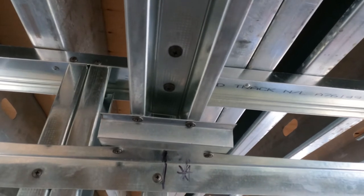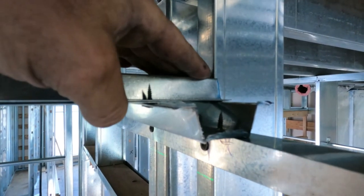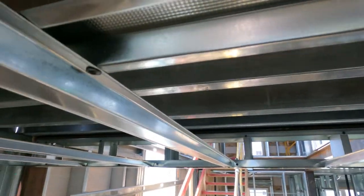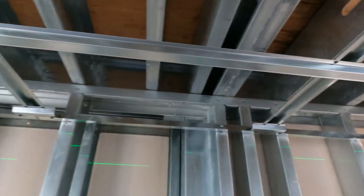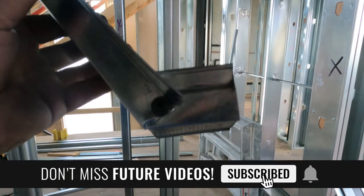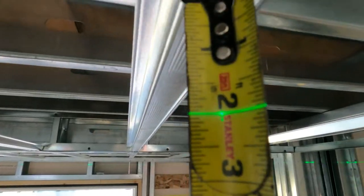Look at the screws — that's what I'm trying to say. You see how the hat track brace goes all the way to the back side of that other little piece that's only like four inches long? That's the important part for the bracing — it has to go all the way. It has to touch both sides of that little piece of hat track, and screw in both sides on every single ceiling piece of furring bar that hits the brace. I screw it in from one side to the other. Always put screws in the bottom of the brace so that the ceiling doesn't drop on you. You don't have to put them in the top one, just on the bottom.